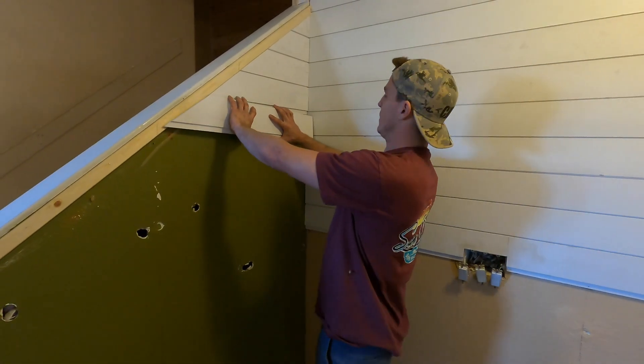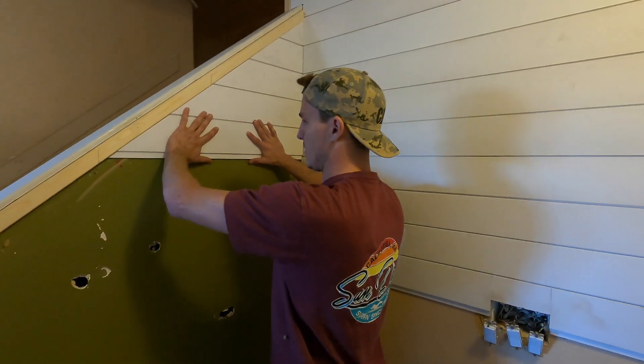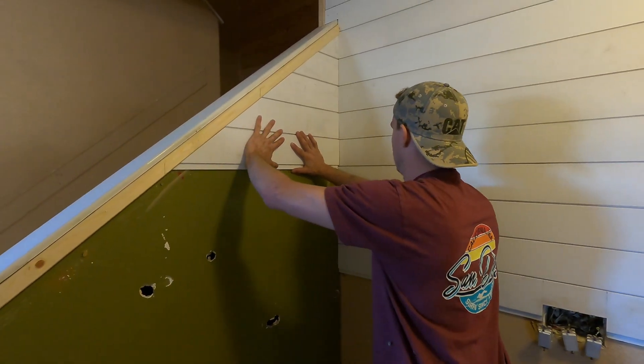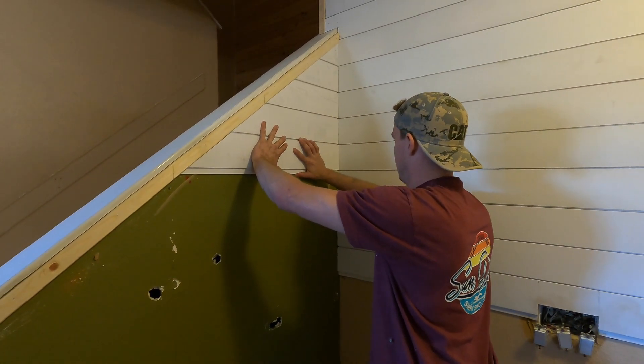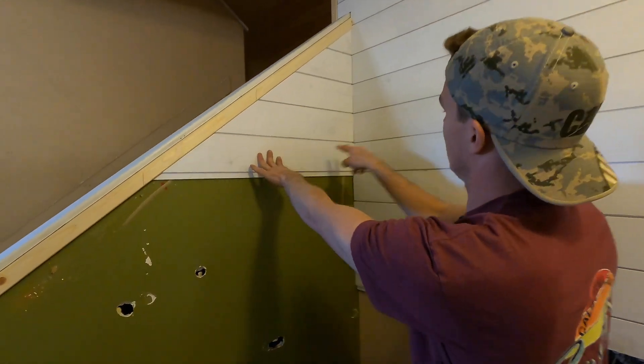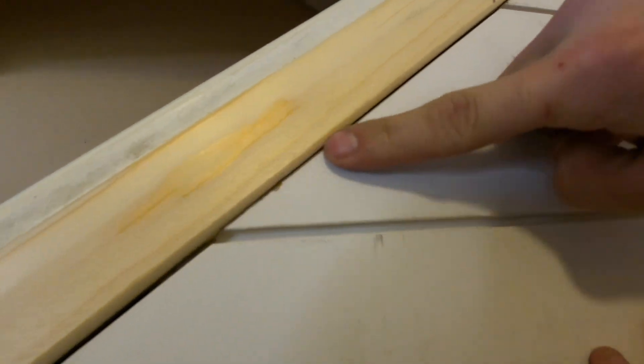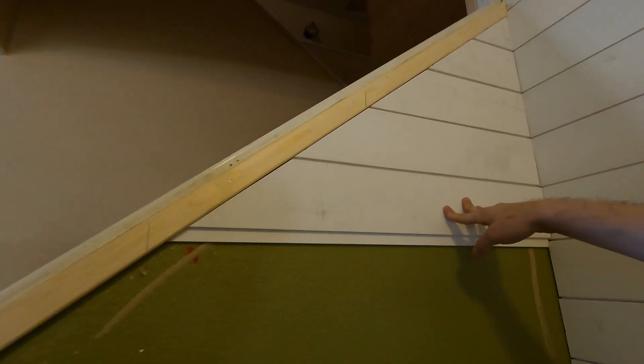This is the board that we just cut. Look at that — lines are in line. And if there's a small tiny gap, you just caulk that tiny little gap because it's a fluctuation of this trim board. Super clean, and you nail it away.